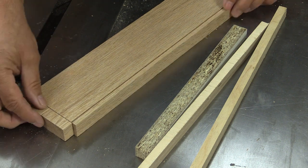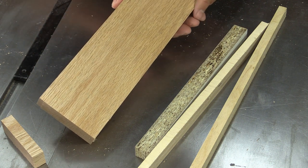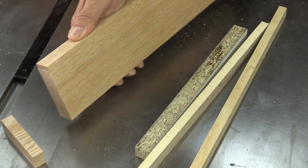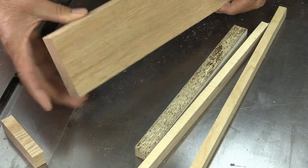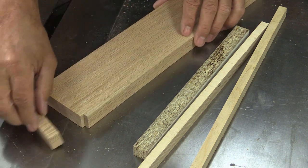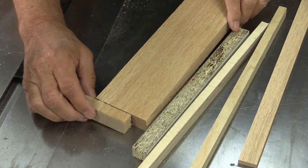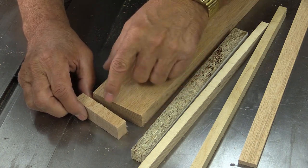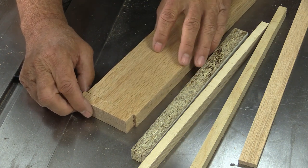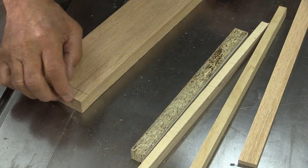Let's have a look at our results. Here's the board that I just ripped — this is oak, and this is the underside. Honestly, that's actually better than I thought. When you put that together like that you can't actually see that seam, so that's really good. The ripping is very good. The cross-cutting is not so great — you can see the little tear-out there at the bottom. Depending on what you're doing, that may be acceptable.